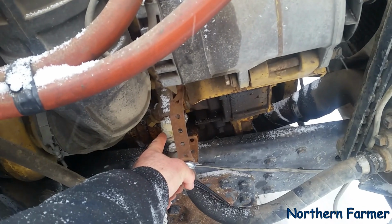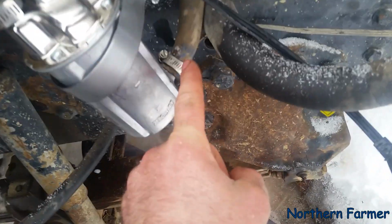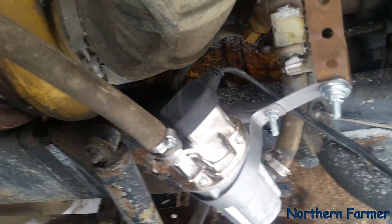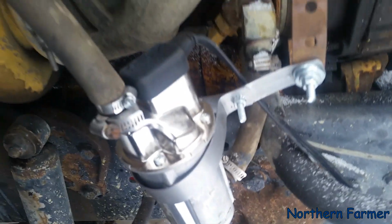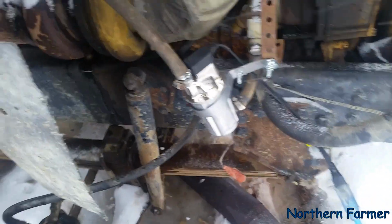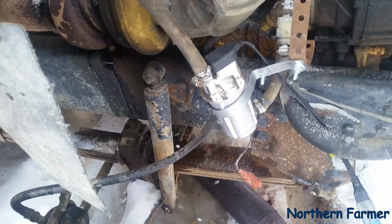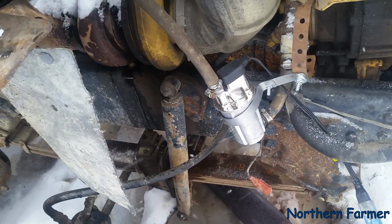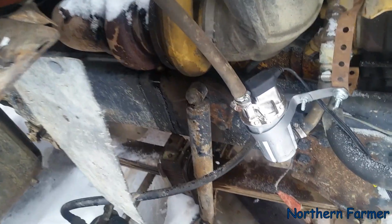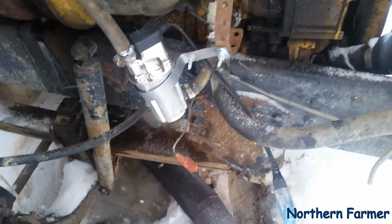What I did was this one had a 45 degree angle here, and it was facing upwards, and it would kink the short hose. So I turned it down so it faced downward and lowered the heater down, and I got it to work better. But I'm pretty sure I had an airlock because I was squeezing the hose like that. I got it to run for a couple hours. When I came back, I unplugged it, and then I plugged it in at 3 a.m. this morning. When I came back here, it wasn't going again. So it seems like I got another air leak or an airlock in it. I know this Cat motor is leaking antifreeze by the pump, a small drip.